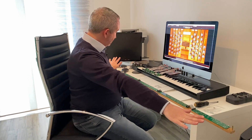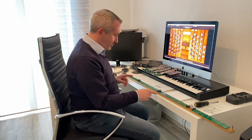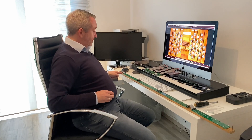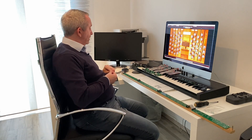I've got the pedals and pedal electronics in the right position. There are 30 reed switches activated by a magnet. These little round magnets are just screwed onto the end of the pedals themselves. When I press a pedal, the magnet comes towards the reed switch and closes the circuit; when it moves away, it opens the circuit again. I don't know if this is going to work, so let's find out — moving the magnet towards one of the reed switches...